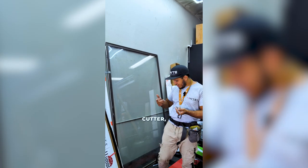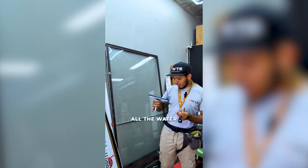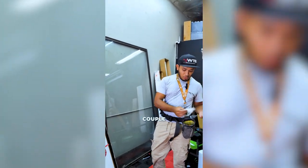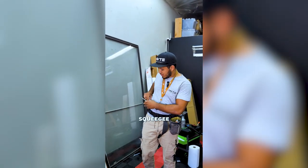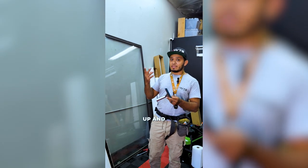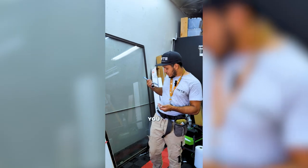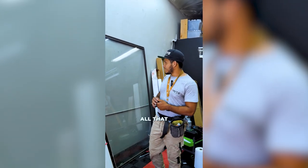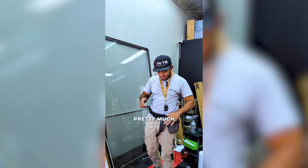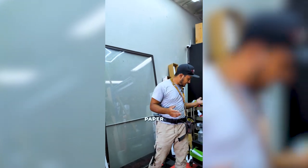The basic tools you need are a cutter, a hard squeegee to push out all the water, a clean squeegee, and maybe a couple of hard cards. You have to have a good squeegee — if not, you're going to have issues with bubbling, callbacks, and it's just a disaster. Your punch list should be: olfa blade, cleaning squeegee, power squeegee, a couple of cards, and paper towels.